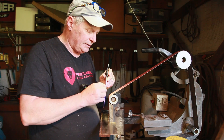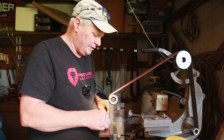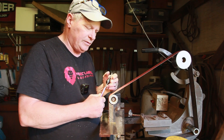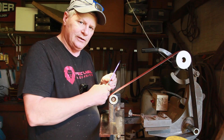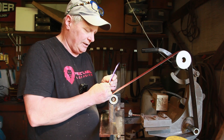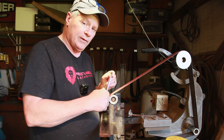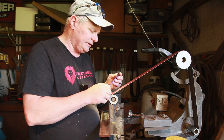I got some center marks here — they're about 40 thousandths apart there, 30 thousandths there about. What I'll do is come in here and grind about a 35 to 40 degree angle down to those lines. I'll use a dull 50 grit belt to do that, then put on a fresh belt. I like to do this on my hidden tang knives where I have something to hold on to — my fingers are kind of stubby and it's hard to hold this tang. I'll start on a flat rest to establish those grinds and start my main bevels, then move on to the guards after finish sanding.